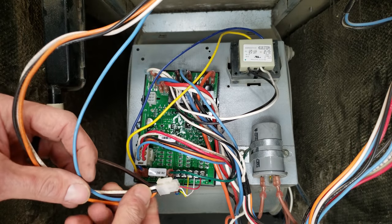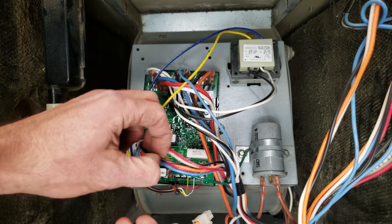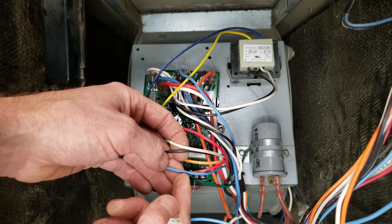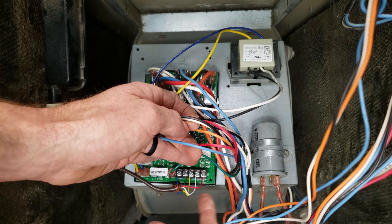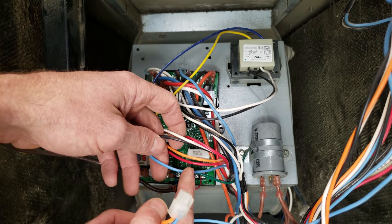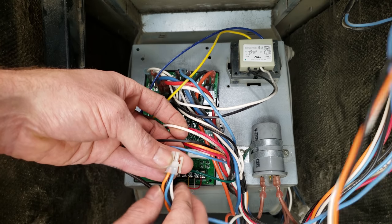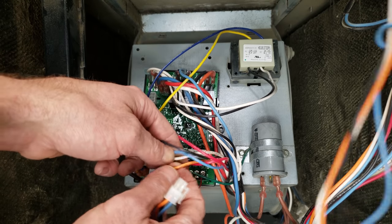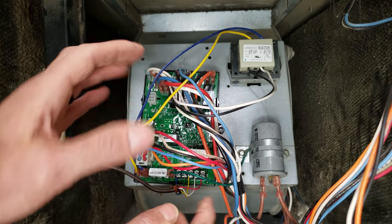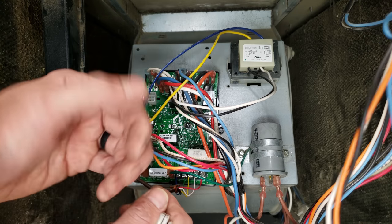Down in the blower compartment, the wire from the smart valve connects to the control board here. The black wire is constant power to the smart valve, the white wire is common, and the blue wire carries the heat call from the thermostat. When calling for heat, 24 volt power is sent through the pressure switches into the plug. If the pressure switches are closed because the inducer motor is working properly, the smart valve has the power it needs to operate. After that, power is brought back to the control board from the smart valve, signaling the control board to start the blower on delay — waiting for the heat exchanger to warm up — then the blower motor turns on and pushes air across the heat exchanger to heat the building.